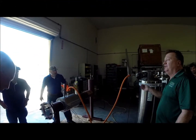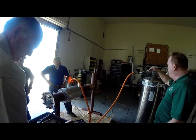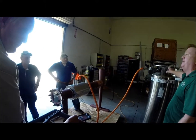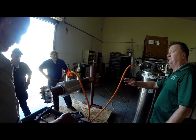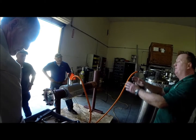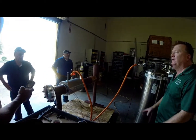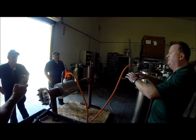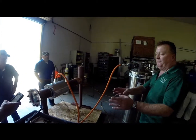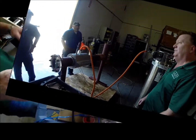So it's nitrogen flow. The first thing we'll do is we're going to have to give it a couple of minutes. When we first open this valve, odds are we're going to be shooting gas for a minute or two. We need to give it a couple of minutes until we're shooting liquid. We need to check for leaks, make sure we don't have any leaking liquid nitrogen anywhere. Once we've checked for leaks, we know that everything's hooked up properly, then we can go ahead and turn it over to the controls on the controller and we're off.